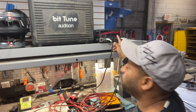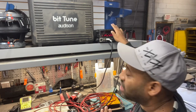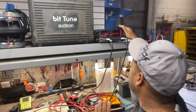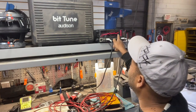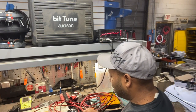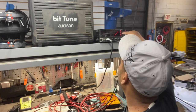I hooked it up to the tweeter with no cap. The reason the tweeter didn't blow up is the generator can only generate one watt — one volt RMS — so at one volt you're not blowing the tweeter up. But as you can see, the tweeter is getting everything from 20,000 Hz all the way down to 20 Hz. Now I'm going to move the jumper to the other side, through the filter.